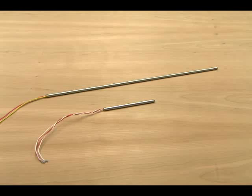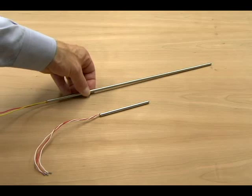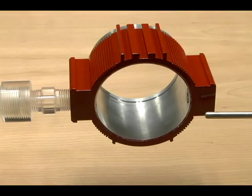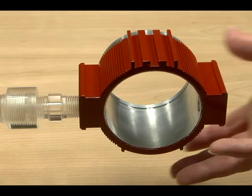Here's a typical sensor element. It's encased in a rigid stainless steel housing that provides protection without slowing the response time excessively. Where circumstances are favorable, this is an excellent way to go. On the other hand, that rigidity is one of the biggest drawbacks. You must be able to push it straight into the thermal well, which means that you must have its length and more of free space. In most cases you will need to remove the transmitter housing, which makes the replacement process all the more complicated.